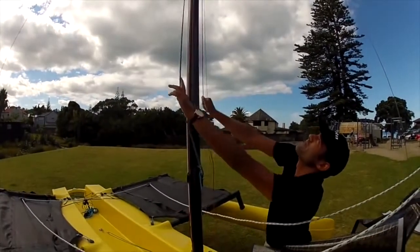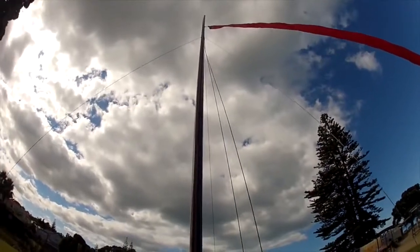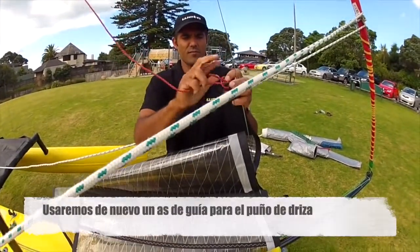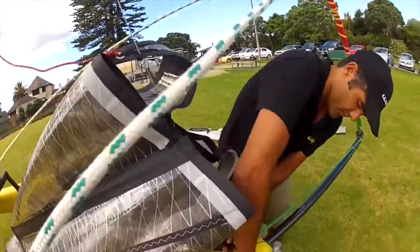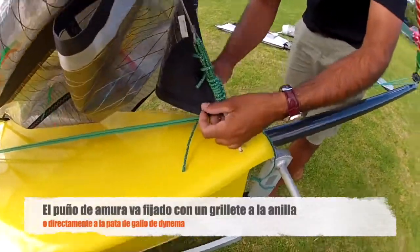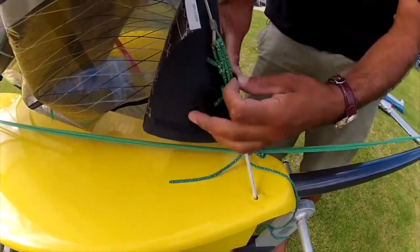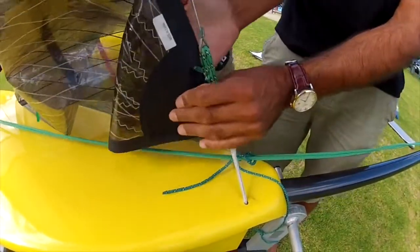One common problem which I've seen happen a lot: when the main halyard is inside the jib, you won't notice that until you go to hoist your main and you'll have to drop your jib again. So just tie a simple bowline on here, and at the bottom I just shackle that on - finger tight, all good. Now this bottom jib hank here, you don't actually need to have it. Some people like to put it right around the actual lashings there. I've played around with it - doesn't seem to make much difference to performance.